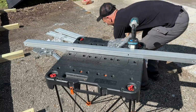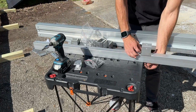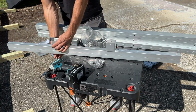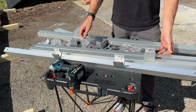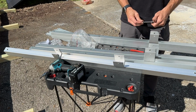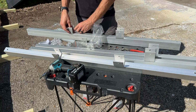Then in terms of assembly, we'll start off with just the 4 different legs. This is going to be the most hardware, and it is smart to kind of take it easy on yourself, and instead of just an Allen wrench, go ahead and make sure you have a bit for an impact driver. I did dial down the torque my impact driver would deliver just to make sure I don't damage anything, knowing we have aluminum, and aluminum is overall a fairly soft metal.